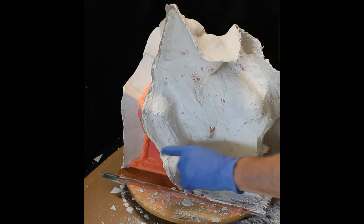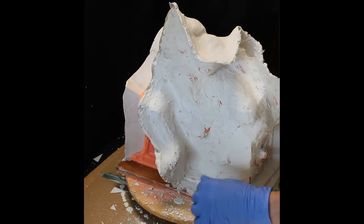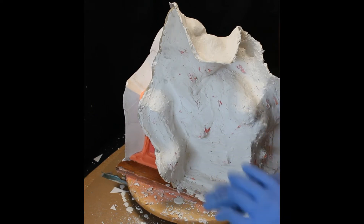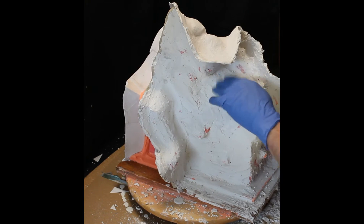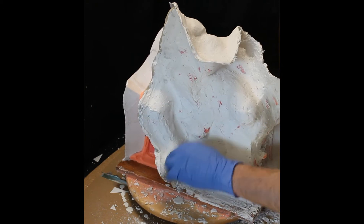This is the first layer of plaster. The thing about mixing plaster is it behaves differently depending on preparation. I mixed it up, didn't let it sit, just mixed it until it was wet. As I'm slapping it on you've got about 15 minutes before it sets. It was still soft when I knocked down the high edges — chunks sticking up — so that I could lay the fiberglass cloth down on top without a huge lump underneath.